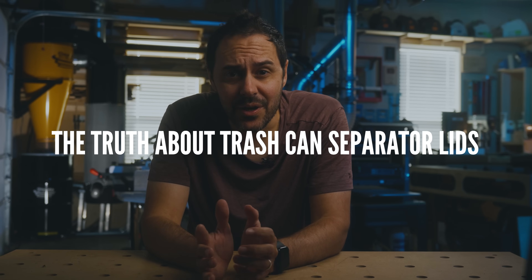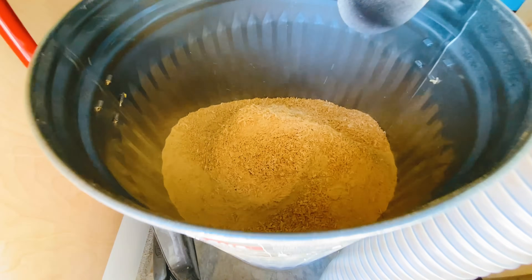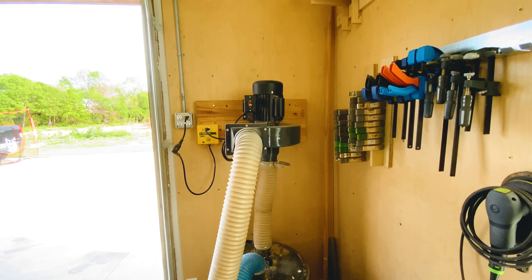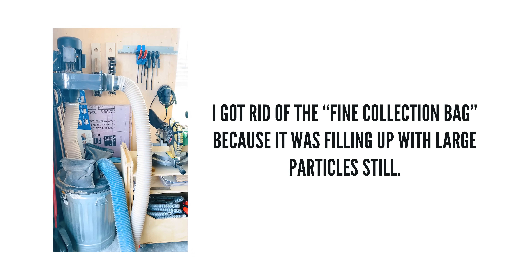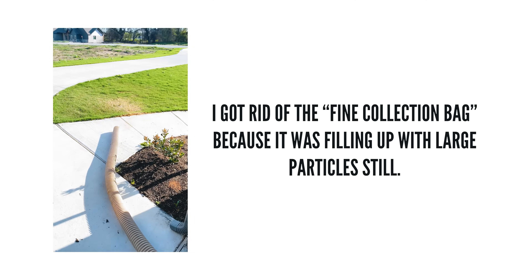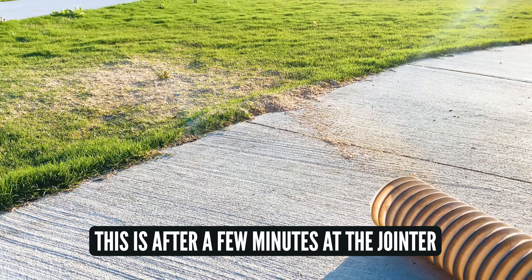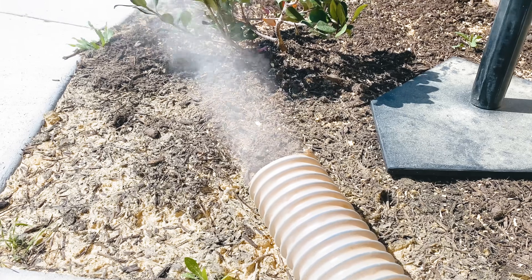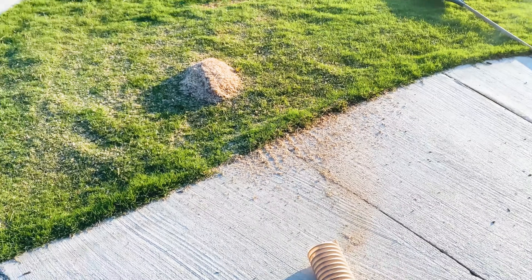My first attempt at using a separator was basically useless. Because the separator wasn't separated from the dustbin, once the dustbin filled up to about 30% the sawdust would get sucked up into my air filter. I bought a trash can separator to limit the amount of times I'd have to change my bag, but what would happen instead is the bag would still fill up — and because I wasn't expecting it or paying attention, it almost always overfilled the bag creating a giant mess, which meant stopping what I was doing, putting a mask on, getting a vacuum, and all of that. Basically once you get to about 30% full, the cyclone still goes but it just picks all that dust back up and puts it into the bag. You think you're separating but you're not.